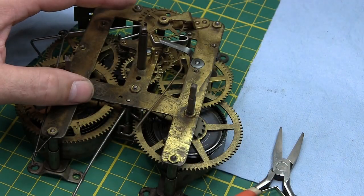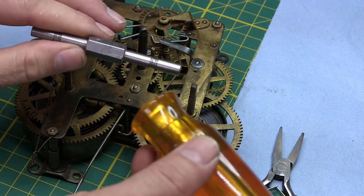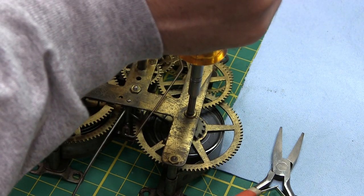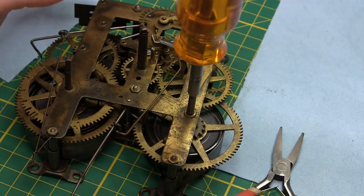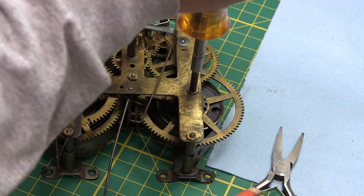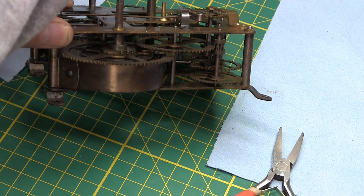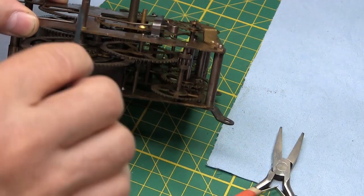We're going to fully wind this. As it winds you can see the click — it's right there. One spring turns to the left for time, and the other turns to the right for striking. They both turn towards the center. I'm going to wind it up to the point where I can get the clip on it. Some clips are smaller and bigger — I only have this size, so I hope it fits. I put it through the bottom part here, thread it through and turn it, see how it goes around the other side.